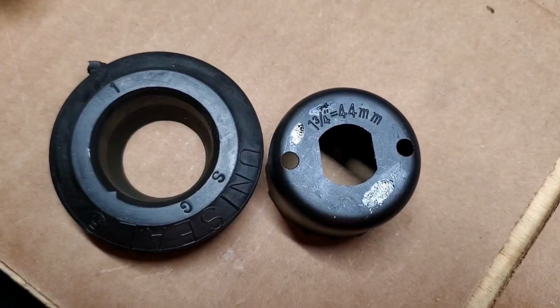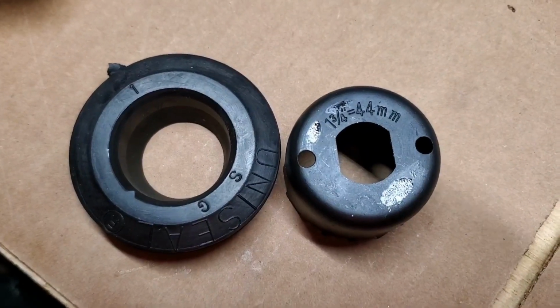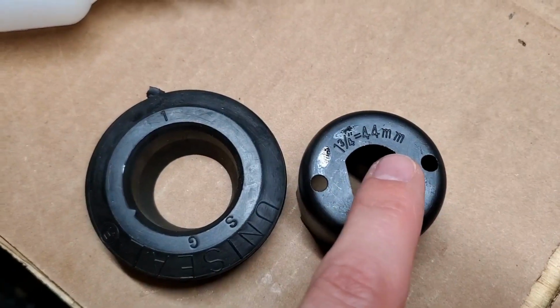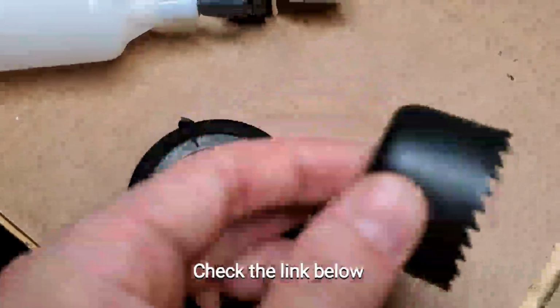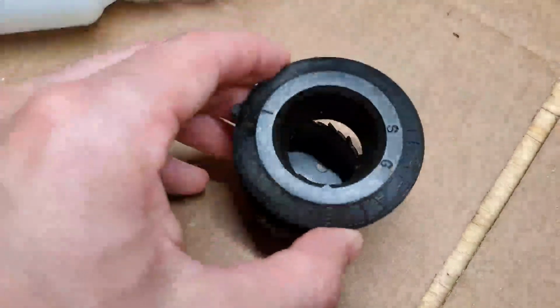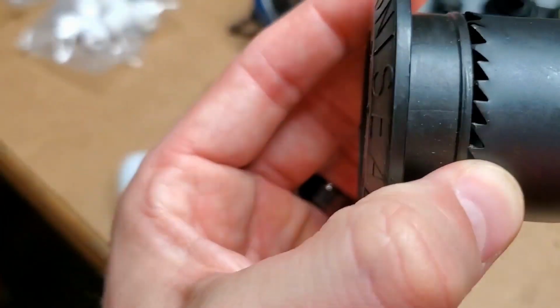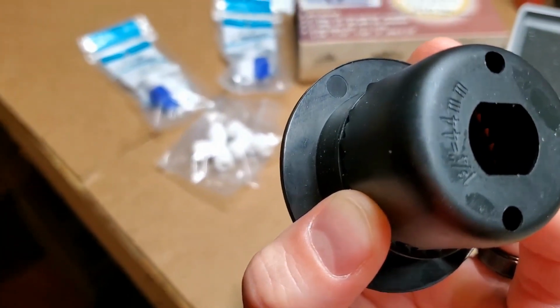Now I'm going to put a link below to show you what type of hole saws you need for each different Uniseal size. But for a 1-inch Uniseal, you need a 44.4 millimeter or 1 3/4 inch hole saw. And that will make a nice snug fit, lining up almost perfectly, where it's going to have just a little bit of a tight squeeze.